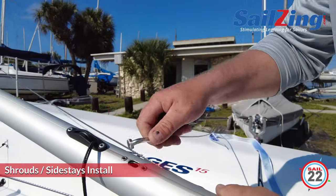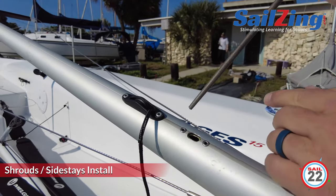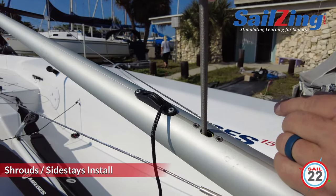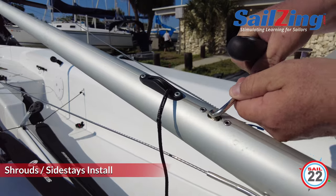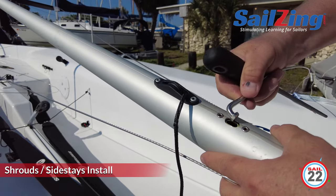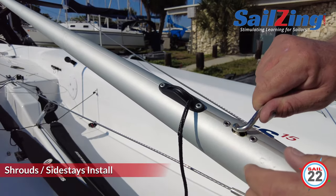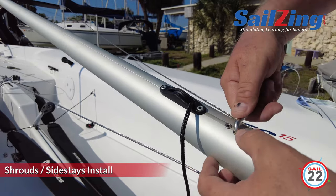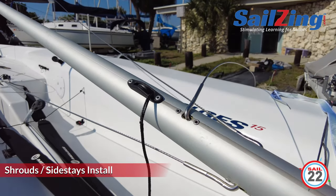Okay, so if you have a tight fitting, this one's pretty tight, you're going to be doing this a lot. This is called a rat tail file, and just don't hit it too much. It probably got squeezed just slightly, and you don't want that, see, that's a little tight. So you just want to get it cleaned up. So when you do it again, you can almost see it looks like it's bent right there. Sometimes it'll go in one way better than the other as well. So see, there it's in, boom. So I didn't do too much. It won't get tighter. So there you go, you're on.